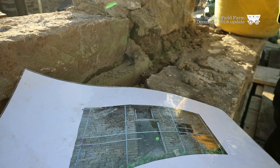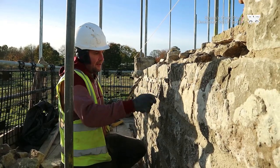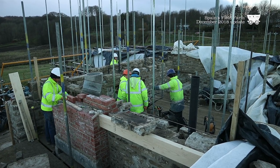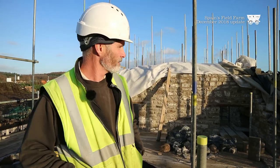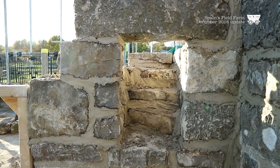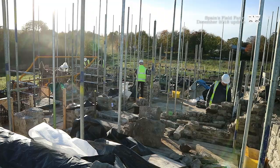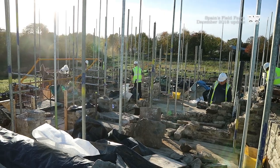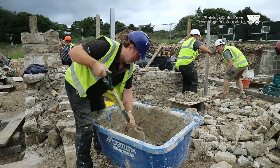We will be stopped by the weather, but we'll be back after the bad weather. It's now December. The sun's shining today of course, but yesterday it was frozen cold. We can't work when it's three degrees or below, so it has to be wrapped up. You'll see they're wrapping some of it already, and you'll see it on the gable end over there. It'll be wrapped up for Christmas once it gets too bad, and we'll come back to it in spring. It's because it's built with lime — the lime mortar doesn't work if it gets too cold; it separates from the sand and becomes a powder, so you lose its strength. So it has to be carefully built.